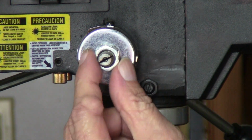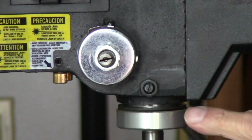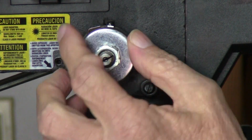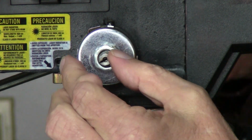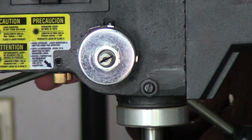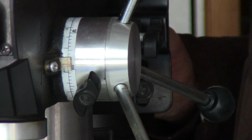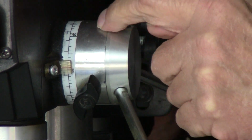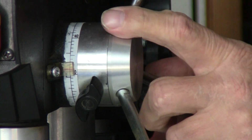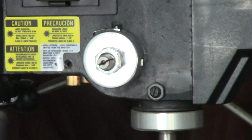Okay, what you want to do is take off the two nuts. One's a locking nut, one's a nut for, if you notice, this going up and down, then there's a spring in here. So you're going to take off the nuts, remove the spring slowly because it'll bounce. So take the spring off, then the other side, this will pull through. When it pulls through, you want to sand the parts. You want to sand the inside of this and get all the burrs off. Put some new grease in it. Now I use high-speed bearing grease. It works great. Put it in there, put it back together.